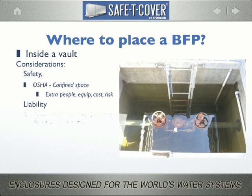But beyond the cost of safety for on-site workers, liability issues persist. When a vault floods like this one, the mandatory test cocks are submerged, and in that event, a violation of the International Plumbing Code has actually already occurred. The water may look clean, but consider what would typically make up the constituents of that water. Runoff of lawn chemicals alone make this a clear and present danger to the water supply.